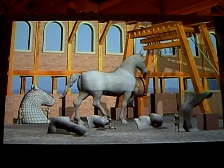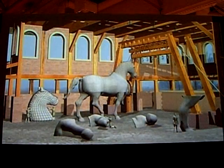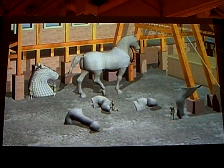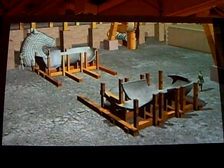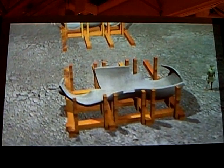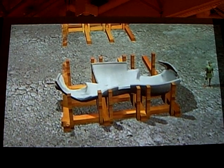After having been suitably shaped and reinforced, the pieces are put back together again to form the negative of the horse's body divided into two halves. Inside the two halves, mounted on a special framework, is applied a layer of potter's earth having the same thickness as the statue, so as to reduce the volume of the cast.